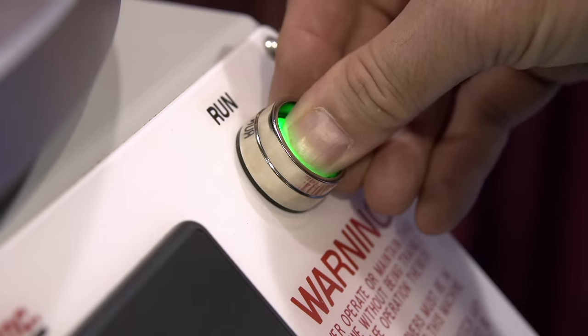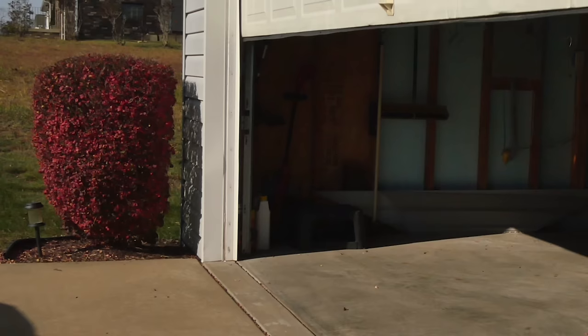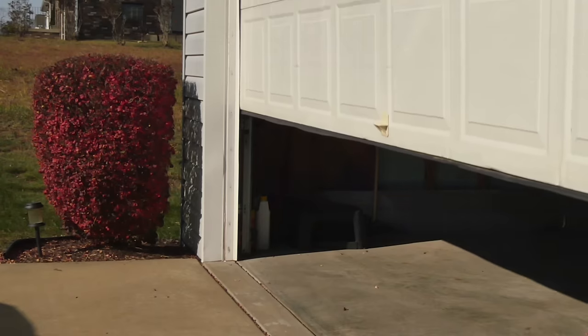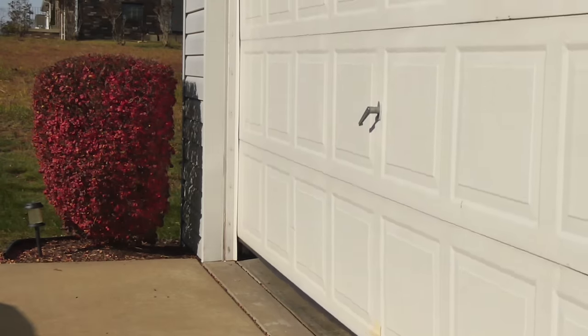For example, a garage door opener. Push one button, the motor starts, and it doesn't stop until a limit switch at the end of the door's travel opens the circuit. Of course, you'll also want to design in some safety interlocks and other stuff, but hey, it would work. It might also kill someone, but it would work.